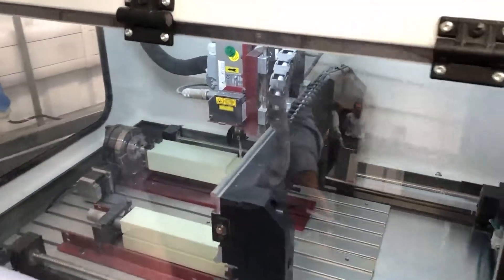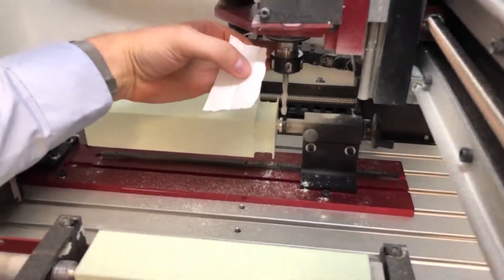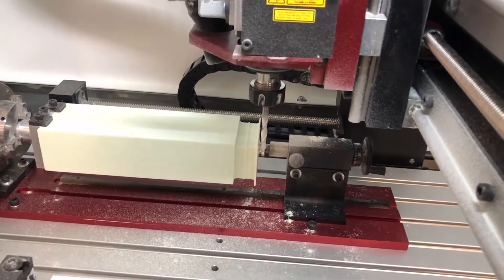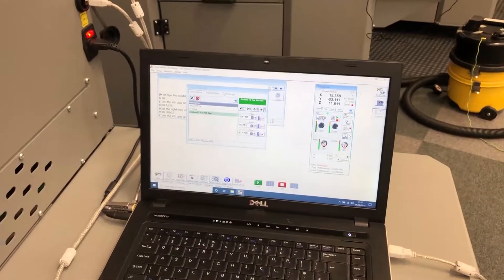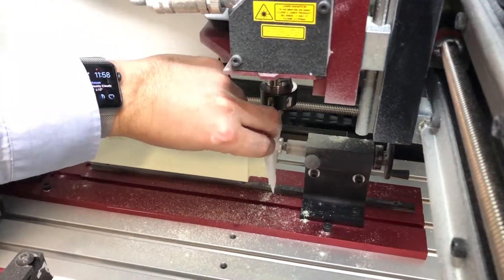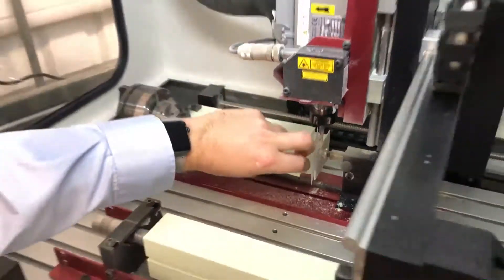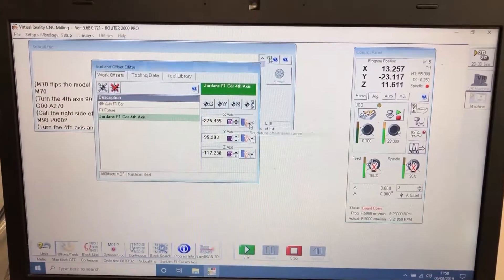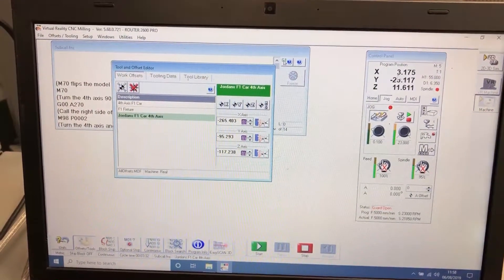Like before, we need to make sure we rotate the tool so we're using the full width of the cutter. When somewhere near, go back to the computer to activate incremental mode with the three arrows, then back to the machine with the paper, moving the tool in slightly until we grab the paper again. Once we've grabbed the paper and cannot move it, we're back to the computer. In the Work Offset menu, touching on the X blue button, enter 3.175 plus as we are on the right-hand side of the billet. The offset has now been reset.